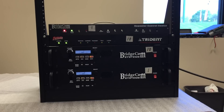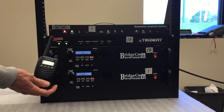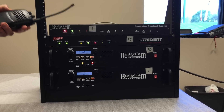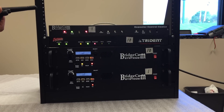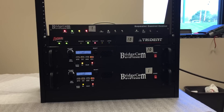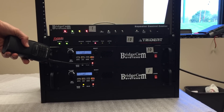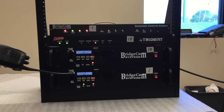Now I've changed to a different group on the Kenwood to simulate two different talk groups. I'm going to busy out channel 10, which is the Raider, and now the Kenwood will trunk over to channel 1. Check one two. Now we've busied out the Kenwood on channel 1. I'm going to let go of channel 10 and you can see it's still keyed up, indicating that any mobile coming into service will get trunked over to channel 1.